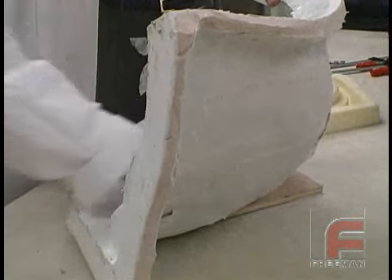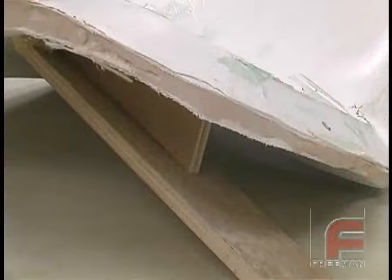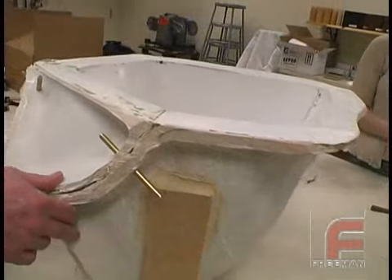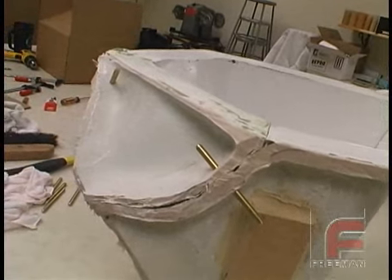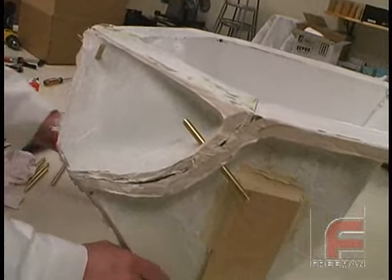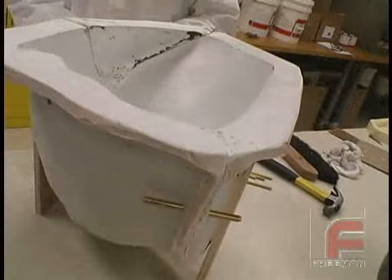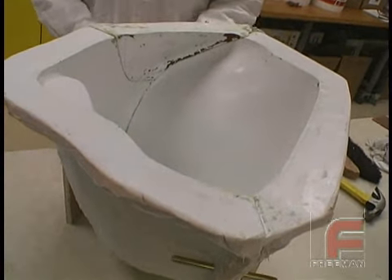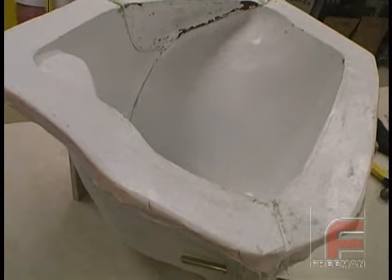Here you see a side view of the paste laminate. Again, had we created this tool using the epoxy laminating system, it would have taken many more hours plus an extra three days to create a mold this rigid and strong. For even less working time, you may forego the fiberglass layup steps, especially for smaller or less demanding projects.